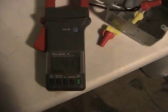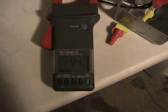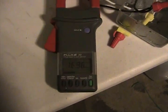I've got the cell up to almost 18 amps. It varies between high 16s and almost 18, which to get 6-inch cells up that high is kind of tricky. I actually moved the terminal jumpers in quite a few and increased the electrolyte concentration pretty strong. That's the nice thing about having the tabs on — you can reconfigure and increase your amp draw. My efficiency is suffering a little bit, but it should be enough to get a good run on the generator.